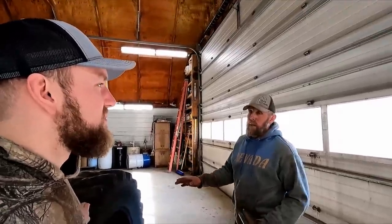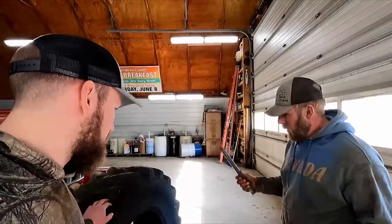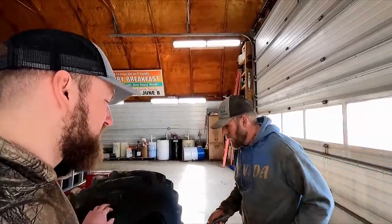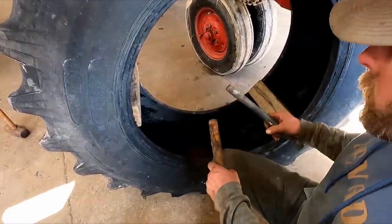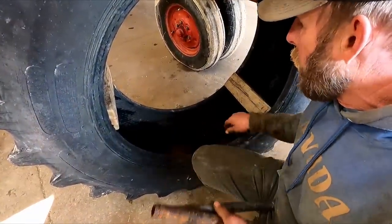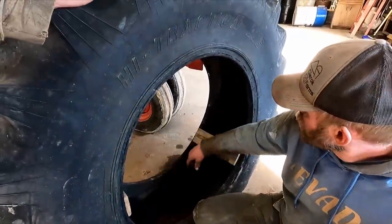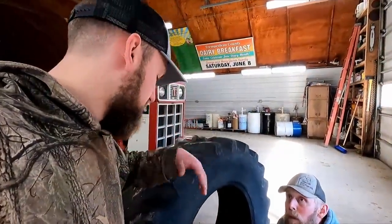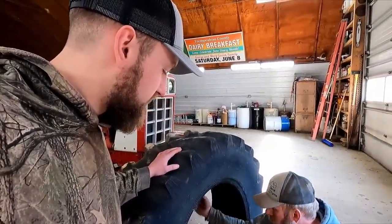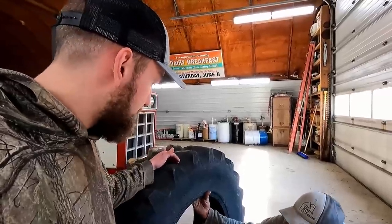We need something better, something away from the bunk — they only need to get to it once a day, maybe not even that, just so they have it and it's out of the range. We're talking about maybe using some old water pipe as a spacer. We got these blocks in there now but I think we can get it a little wider, and we're going to cut a barrel apart to put an insert in the back with carriage bolts — a nice backboard so the salt or mineral doesn't come licking out onto the fence or gate or get stuck down behind. So it stays in the feeder and keeps it drier.